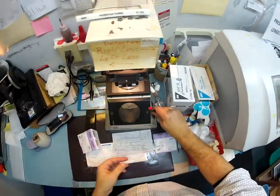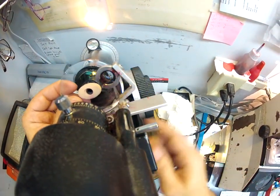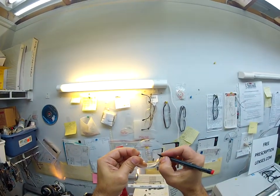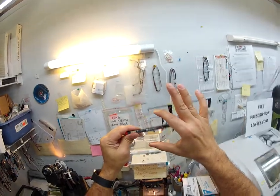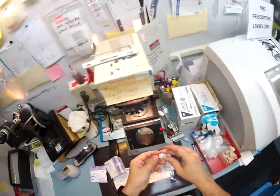Now let's do the same for your left: minus four and a quarter, minus a quarter at 150. Type in minus four and a quarter, spin the power drum, put that in, find your optical center, get everything locked in and clamped, check your astigmatism correction — everything lines up perfectly. Now let me put some dots on these lenses. The reason they're going across like that is I have a straight line to get them on the optical center. There's a block that's going to hold the lens in place in the lathe while it's cutting.